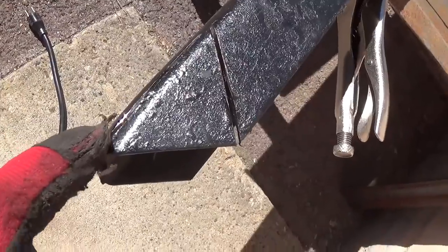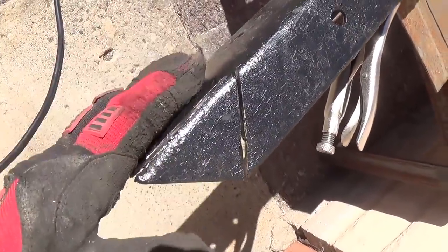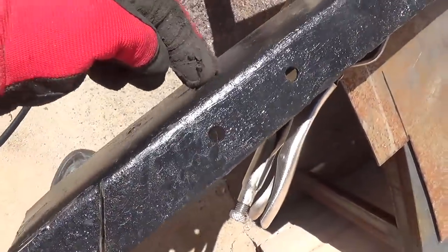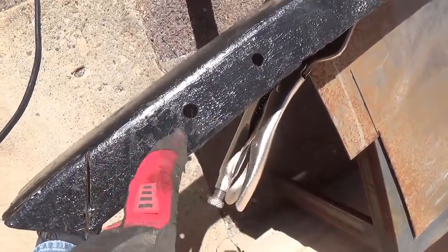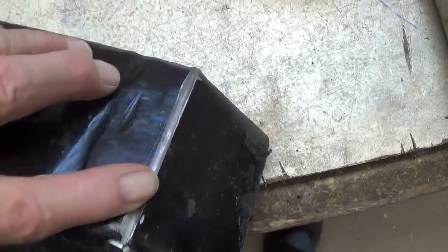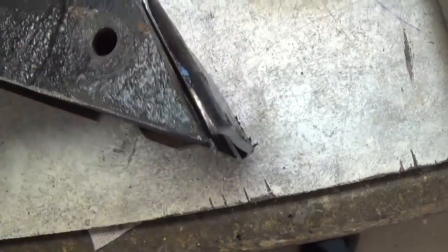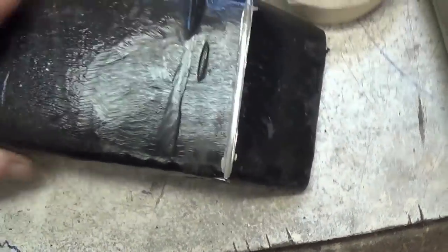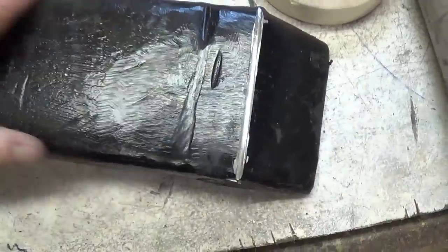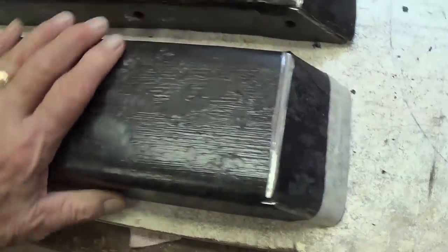My plan to make feet out of this old Jeep bumper is to cut a triangle out of the end of the bumper and then bend the flat part down at an angle so that the feet appear solid from above with tapering ends — trapezoidal, in other words. Now that the triangle is cut out and the flap has been scribed where we want it to bend, we hammer it down to coincide with the angle and create a nice closed trapezoid — one foot made. All these seams will have to be welded and ground. Then following exactly the same steps, we make the right foot.